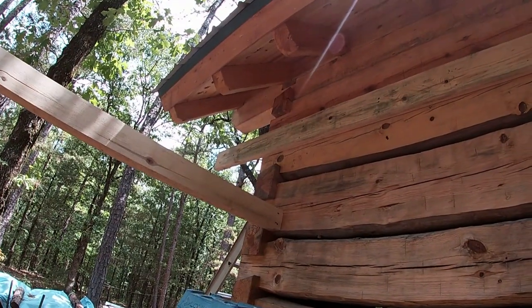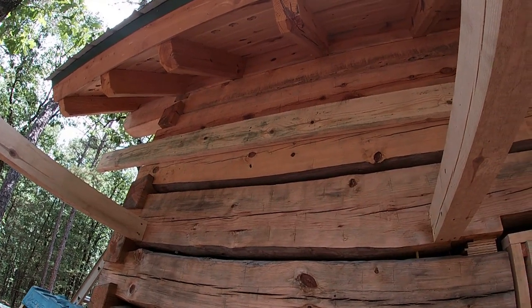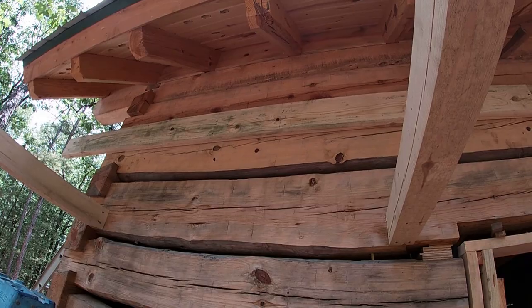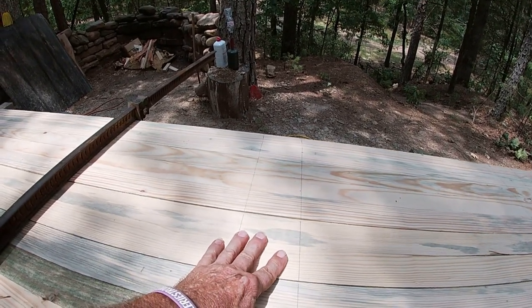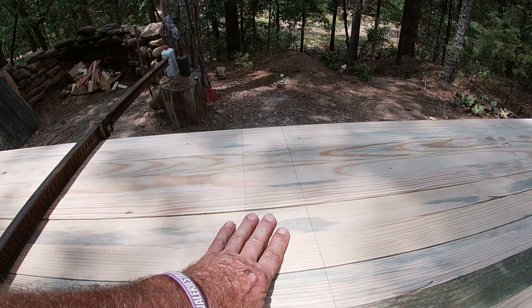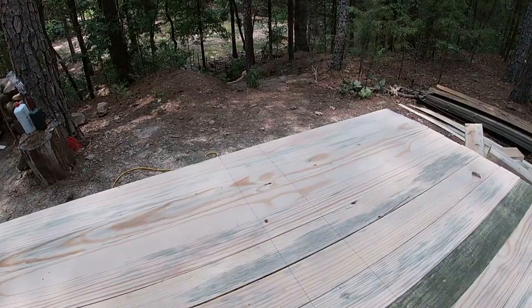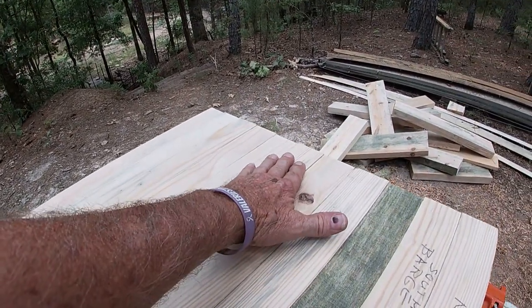I've got the ribbon up that the rafters will tie into up against the building. And I've got the screws screwed in where the rafter itself was set on that. I went ahead and laid the lath out on the top of the rafter so I won't have to do that climbing around up there. I can put a 2x4 lath on, screw it down, and the next one's already laid out all the way up. And at the very top, I'll put two 2x4s here, one at the very peak and then one down underneath it.